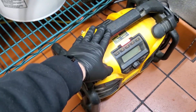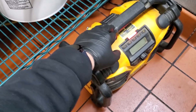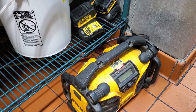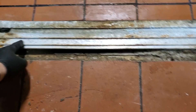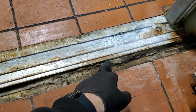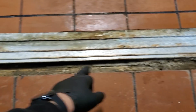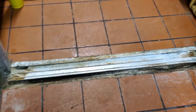We set up a battery charging station so we can have some music while we're working. We got everything underneath the threshold cleaned as much as possible — nice and dry, no more moisture. Because of some crappy grout, we ended up chipping it all out. We're actually going to get a new threshold to cover over that — it'll come clear to here and clear to here — and we can seal it up with silicone instead of grout.